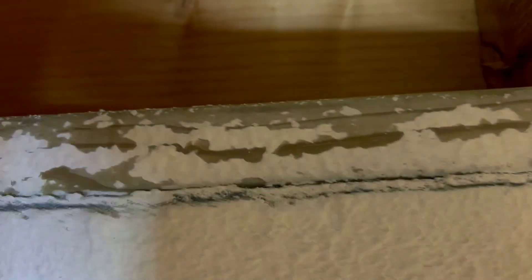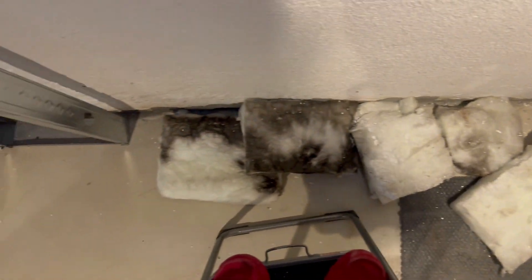You can see how large that gap is right there on the bottom. So there's probably a lot of moisture leaking in through there — I've never had water in the basement, but I'm guessing over here as well. I'm gonna seal those up really good with caulk. Luckily I don't see any rot, which is amazing.